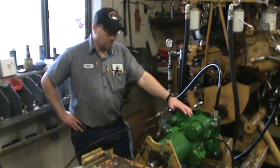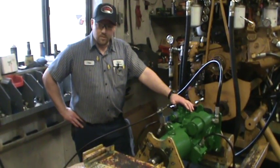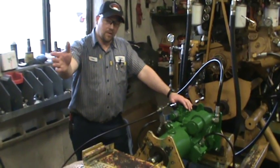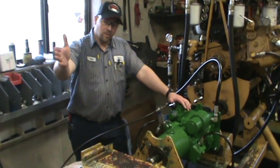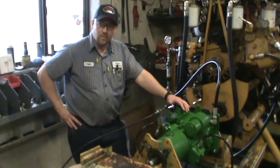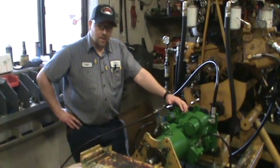I'm going to bring it up — I've got it warmed up already. We're going to run it up and check the pressure on it, and you'll see that on the big gauge over here. We're going to hit about 5,800 and then it's going to float around a little bit when it starts relieving. Our charge pressure used to be at 250 thereabouts. So we're going to crank it up and see what happens.